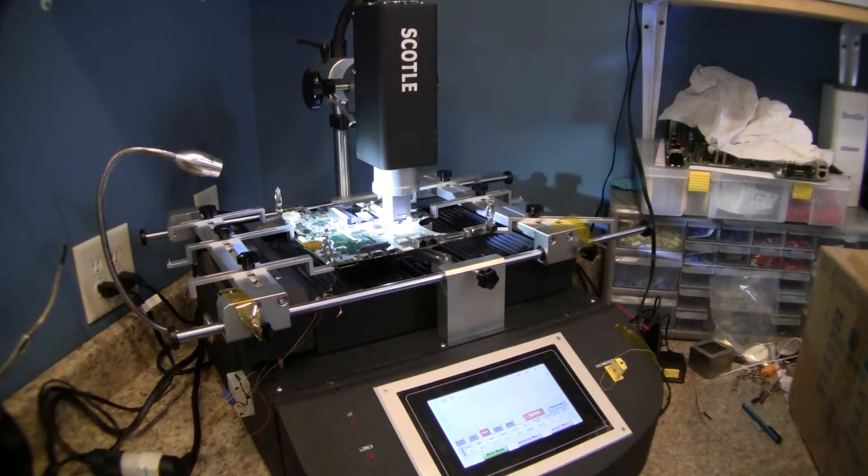So far it's had 100% success. We'll be doing almost a dozen DV6000 and 9000 today. To summarize: you remove the plastics, the board's already been removed from the laptop, make sure there's no battery, and flux your chip as best you can around the adhesive. If you've got a very small gap in the adhesive, allow some time and some extra drops to get good penetration under the chip. Then with the right profile you should be fine.